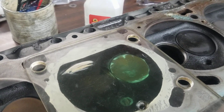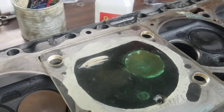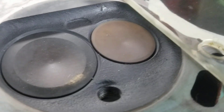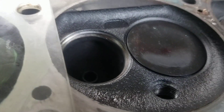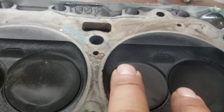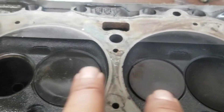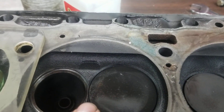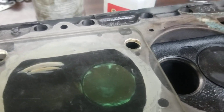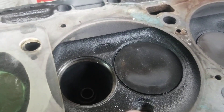That's a lot. You ask the question: why might it be that much? What's going on with this head — was it produced just a certain way? No. What's going on here is the valve job is sunk pretty good. The valves are deep down in because of how they were sunken in. That itself displaces two to three CCs in general. So maybe this head was at 82 or 83, and with the valve job sunken in, it changed it.